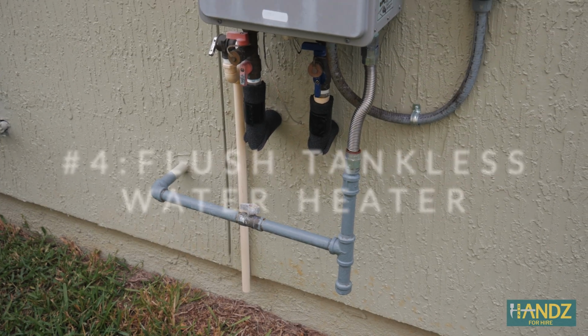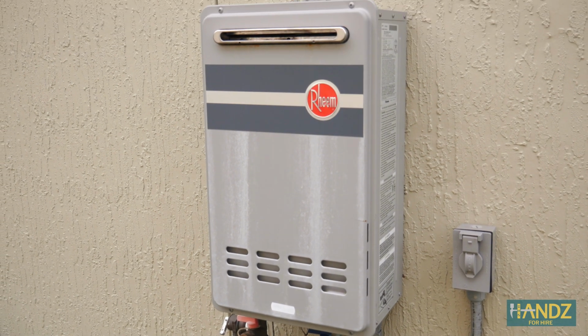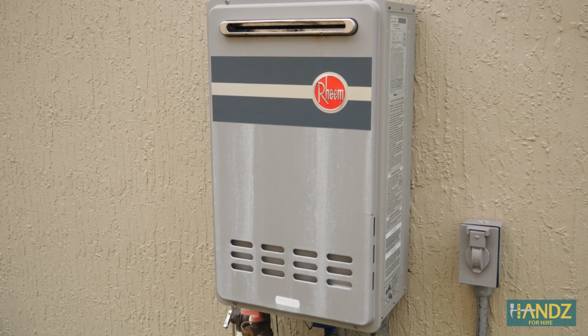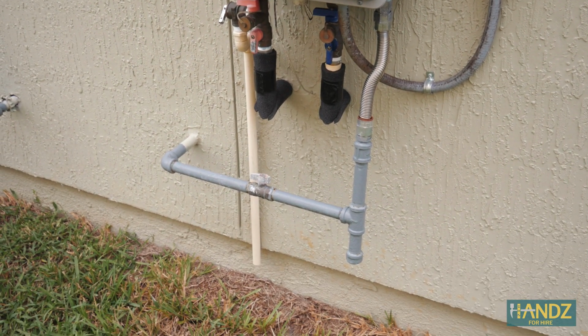Number 4 on the checklist is flushing your tankless water heater, if you happen to have one. If you have hard water in your area, it's important to flush at least once a year, unless you have a water softener, or live in an area where there's really not hard water, then you can flush it every few years. Now, I made an entire video on how to flush a tankless water heater, so I'm gonna link it below in the description. Check it out if you need to.